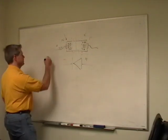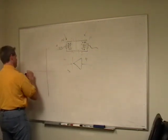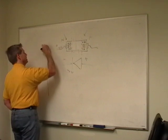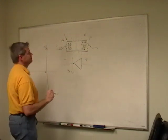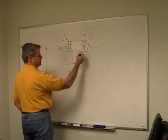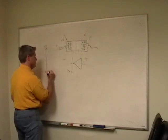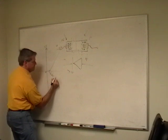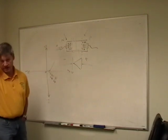But what happens is, if I were to make a graph of voltage, negative voltage, 0 volts, and current, positive current, I'm gonna call it negative current, it's really just the direction it's flowing through, right? So what we see is generally in a silicon diode, when you have a positive voltage on here, we generally look at it as this, right? And that knee is at about 0.7 volts. For silicon, for germanium, it's about 0.3 volts, and other materials might have different.